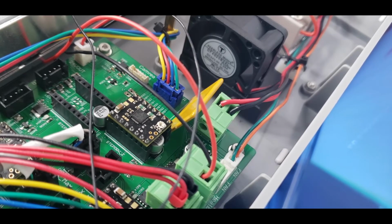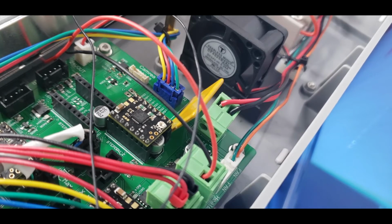Now you need to set it at a specific range for your motor, and there's a calculation that you have to do. For the Flashforge Dreamer people, probably the NX and the regular, you should be able to go off of these settings. However, if you're doing this for a different printer, I do not know what motors you have in there, and you have to calculate this based off of your motor amperage. I'll put something down in the description that will lead you to where you can find out how that works. I will also link to the motors that are in these. You just want to take a picture of your motor, look it up, and find out what the max peak amps are, and then you plug that into your formula.